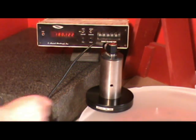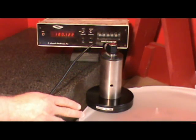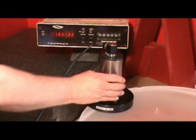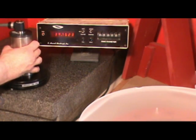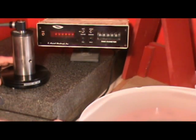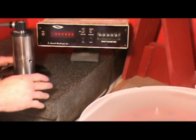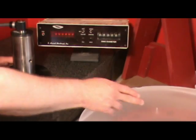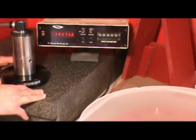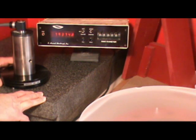So that shows a pretty good sphere on this mirror, in that the radius at the center, the 50 percent zone, and the edge are all identical. Now to do a very accurate reading, what I'd do would be to take a set of three readings like that and then re-zero the spherometer on the surface plate and then take another set on a different diameter on the mirror. I would do that three, four, five, even seven or eight times on different diameters of the mirror so that I can completely map the surface. By averaging all the center readings, all of the 50 percent zone readings, and all of the edge readings, I can make sure that I am spherical on the piece. And of course I'll know exactly what the radius is so that I can plan my next grinding step.